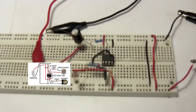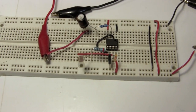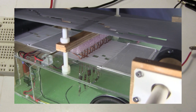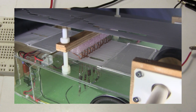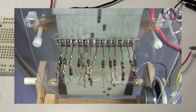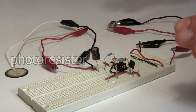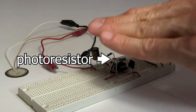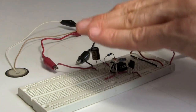Here's the 555 timer circuit I'll be using on a breadboard. It's the same circuit that I used for this music player. In that case, the different sounds were produced by having a strip of paper with holes in it close the circuit between different sets of resistors underneath. But in this case I'm using a photoresistor — by controlling how much light it gets, I control the resistance and therefore change the frequency of the sound.